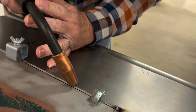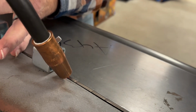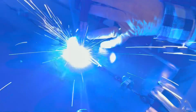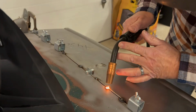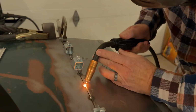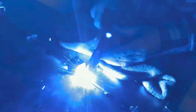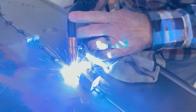With our inner grips holding the panels in alignment, Pat began tack welding our panels together. Moving slowly, one spaced out spot at a time, Pat began to dot his way across the panel. In order to keep the sheet metal from overheating and warping, we followed up some of our welds and wiped them down with a cool, wet rag. Slowly but surely, one pass at a time, the welds began to fill in our seam.